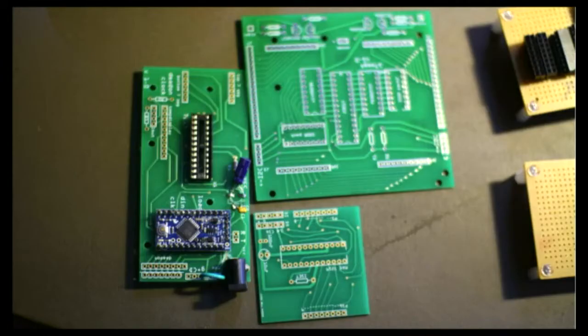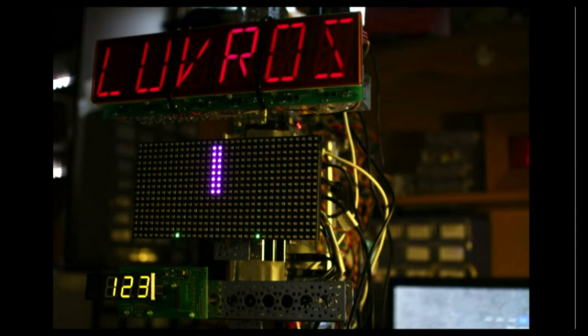These are some of the PCBs. I haven't yet made a board that didn't work, which is great — though I have made boards where traces were broken and I had to patch them. This one is displaying when the claw is in motion. This is another great part of using ROS: if your claw is in motion, you can publish messages saying 'I'd like this XYZ to be where your hand is' and it will work out the maths. Simultaneously, another node listens to that message and overrides what's on screen to show you where the hand is — you can see the XYZ position, and the green dots at the bottom show how far apart the fingers are, which you have absolutely no way of seeing from the front.